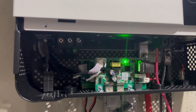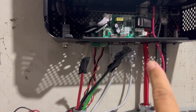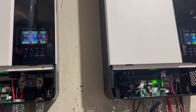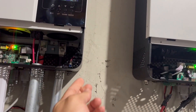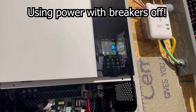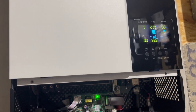All the AC outputs look good — the only things hooked up are the battery and solar, though the solar switch is off so no solar is coming in. Still making that buzzing sound. With only the communication cables and parallel cables connected and the inverter on, it's definitely not quite right. Then I disconnected the PV wires and now there's no buzzing sound — so it seems to have something to do with the PV side or my filter.